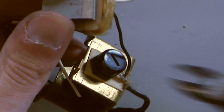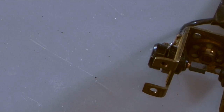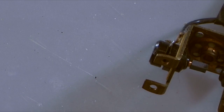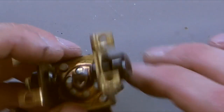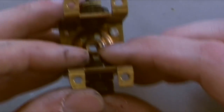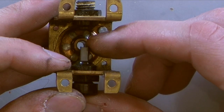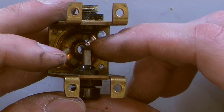And let's cut that off. You can get that out of the picture. And you can see on the main power wires there that the electromagnets are powered off the same voltage and at the same time as the commutators. And we talked about the brushes earlier. And you can see when I took it out, this one popped out. It's the spring pushes it forward. It's a very gentle, very soft spring, but it's enough to do the job.